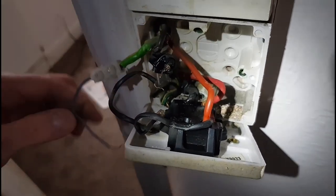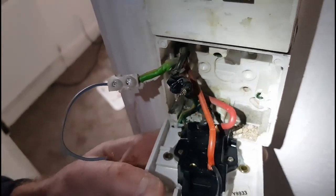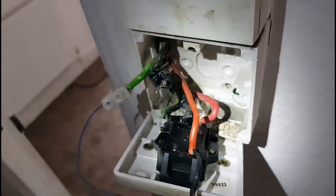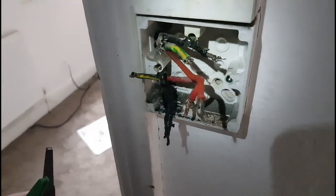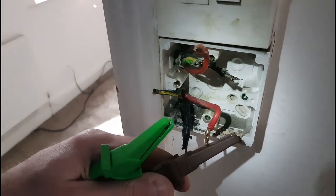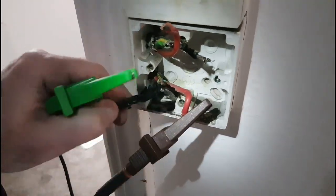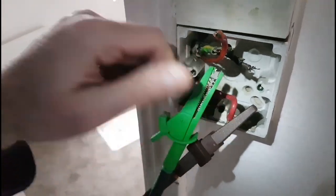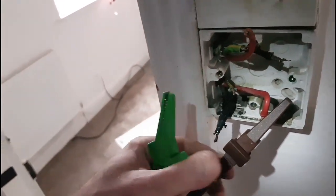I'm going to try and get some readings from this and look at what's going where. Certainly the shower's not in use — there's no shower in the property at all. I'm not quite sure what this is even doing and why it's even powered up. Maybe we can disconnect it if we are doing some updates. I've identified which is live in, coming from the board, and which is live out. I'm going to connect up there. They are quite horrendous connections, but I've at least got a bit of copper to bite down onto. I've nulled the resistance in the clips and the leads. We're getting 0.11 there — so that's that reading. I'm going to try it again now with the neutral.